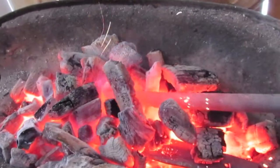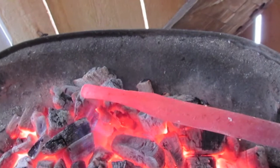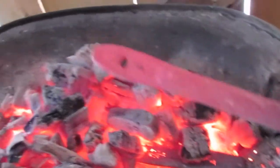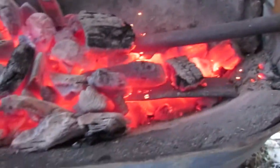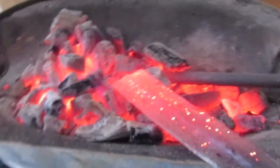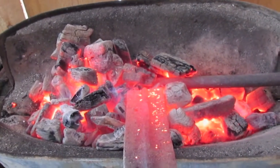I'm trying to use that existing hole that was already in this piece and flatten that to be the eye for the hook, and that seems to be going okay. I think I can effectively drift that out after flattening it — there's enough meat there that we can make that work. By the way, I hate this forge. I made this forge before I was really ready — a couple of years ago, actually. So here's the angle iron flattened out, and you can kind of see what I was talking about — when you flatten out the corner, you get that kind of ridge, which I actually like. I think it's going to make it a little bit stronger.